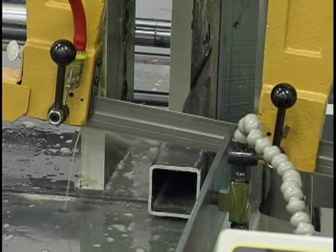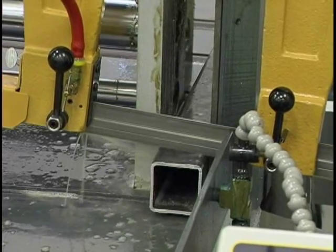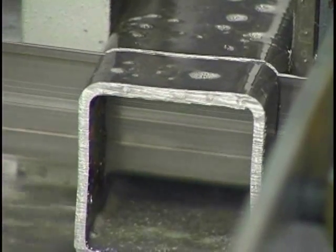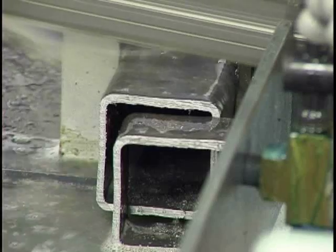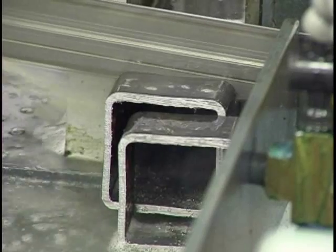You can see the shuttle moving relatively slow because it's within the one-inch cushion programmed into the saw for accurate part positioning. If you are cutting longer lengths, the saw will go slow for the first inch, then go fast, move back to the desired length, and come forward fast until it gets within that one-inch window. Once the saw cuts the desired amount you programmed, it will make its final cut and then shut the saw off.